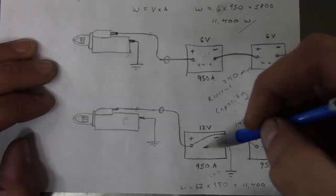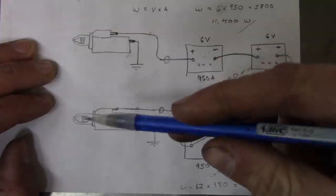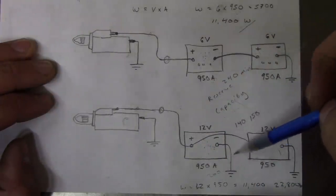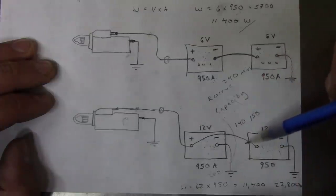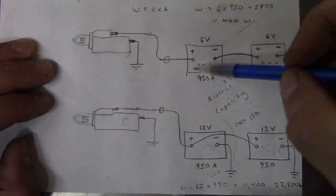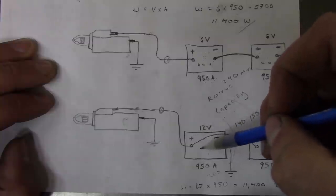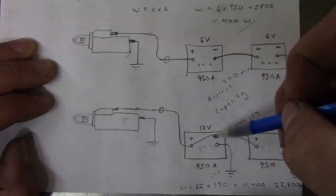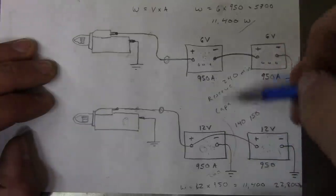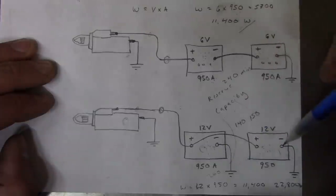So in order to accommodate two 12-volt batteries, I think we're going to have to start over with the cables, basically start that over from scratch. Now, the other thing we could do is just go to one 12-volt battery. You figure in 1967, when this tractor was built, batteries weren't anything like what they are today. And there's probably a pretty good chance that one 12-volt battery, like one Group 31 battery, would start this tractor just fine. But I'm going to go to the store, see what I come up with, and we'll make a decision from there.